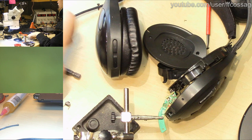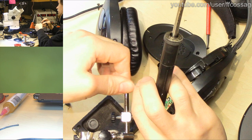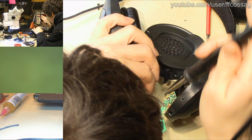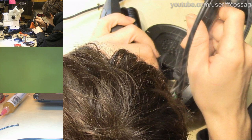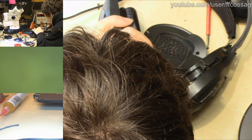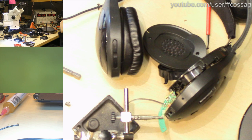So we can just solder this on. Yeah, I can't do it under a microscope. You'll just have to look at the distance, sorry. It's too full here, so I'm getting some flux into the wire there to make it easier now. Just reflowing that on there. One wire. And two wires. There we go. That's soldered in place. I don't think it's shorted out.